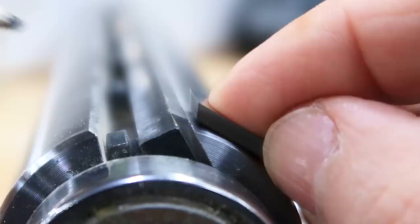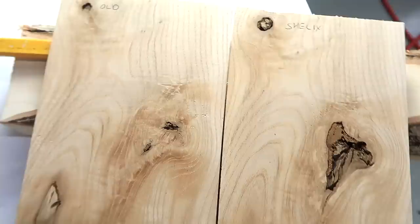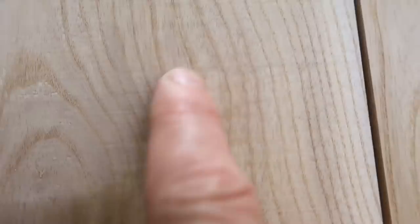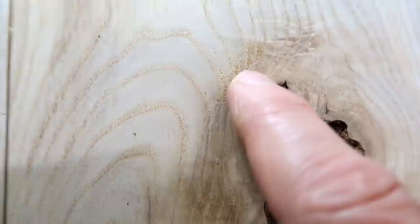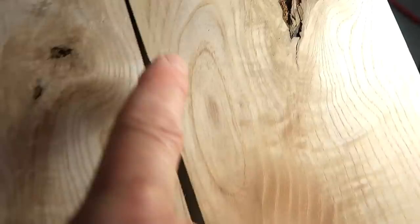I re-sawed the planed surface off some of my workpieces to compare the new and old cuts side by side. This was cut with the old planer head and this with the Shelix head — with the light just right you can see differences fairly well. We have lots of fine lines from the knives on the old head; with the Shelix head much less so. Down here you can really see some of those lines. We also have some tear out with the Shelix head, and with the old head possibly the grain wasn't as bad so it had less trouble. With the lamp on the side you can see where I've got some nicks in the knives on my old head, and you can see some faint lines from those.